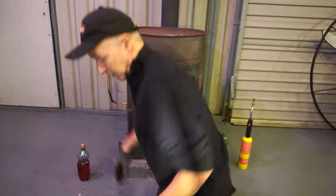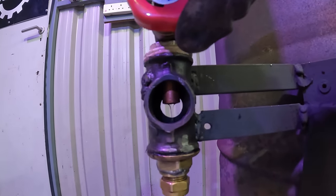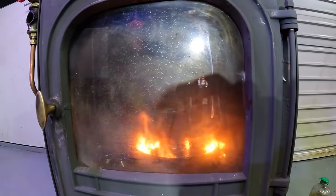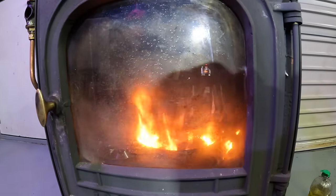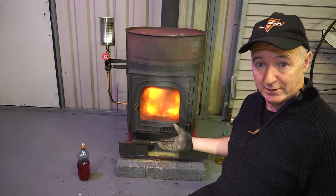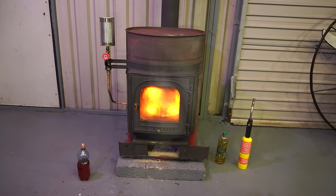We'll add some oil — just want a little stream of oil. As the metal reddens, the oil coming in is going to get vaporized. Hear that? So there we go — we've got a waste oil burner working really well.